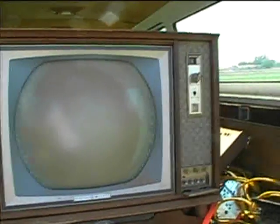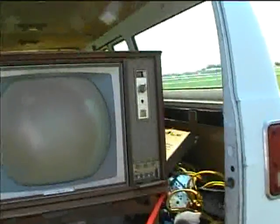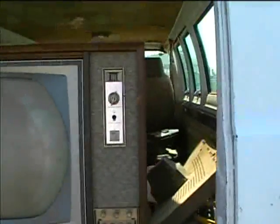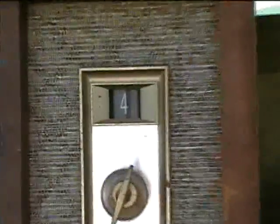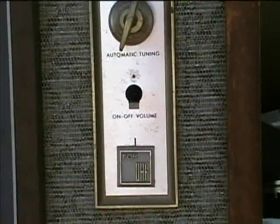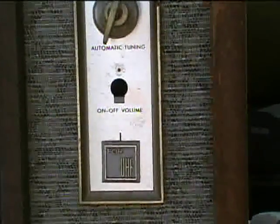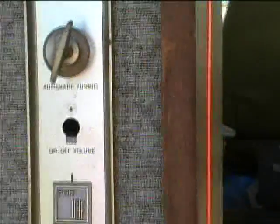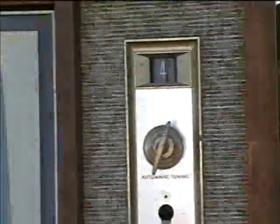There's a lot of PVA delamination on this tube. It's a 21FJP22, and the CRT is actually good. The last time I turned this on was probably about 5 years ago. I got this for $5 at Old Store Head Trade Days in Stanton. The power switch fused in the off position, so I'm going to have to repair the power switch to get it to work.